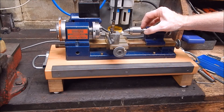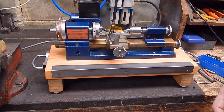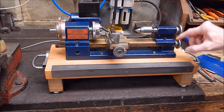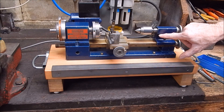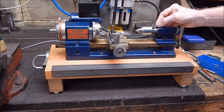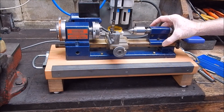Not the taper — and I was thinking it's just wear. When you look at these, on the tailstock there are two bolts. You'd think this bolt here tightens up on the quill, which it would on most lathes, and this one locks the tailstock in position.